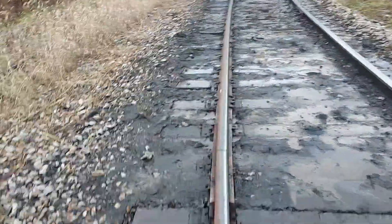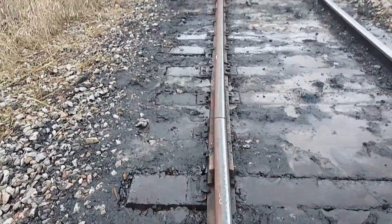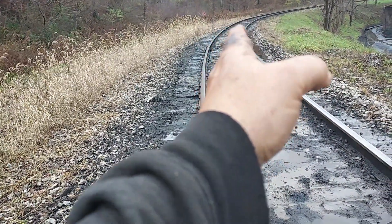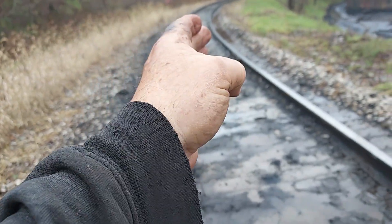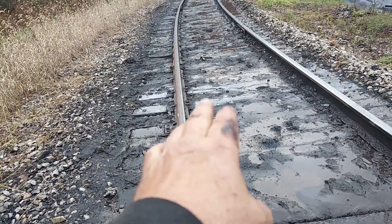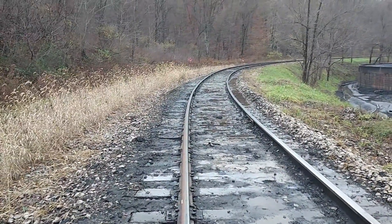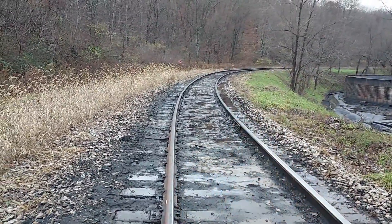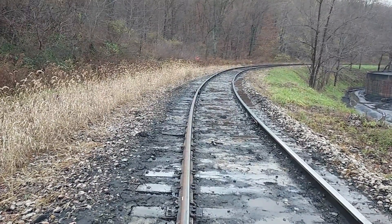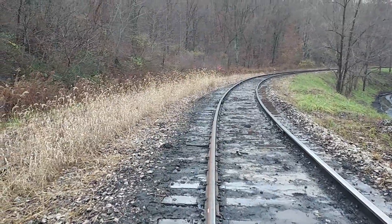This is actually the sharpest degree curve we've got. We changed this rail and the one down there — Sperry rails. A Sperry rail is a rail that has an internal defect. So you can imagine when we lay this stick in here it's going to go straight. Most all rail for freight railroads is straight rail when they buy it. Now they do make some curved rail — it's called pre-bent or pre-curved rail for transit, since some transit systems have an insane degree of curvature.